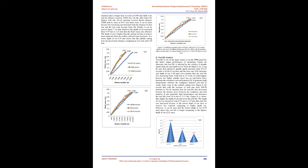Figure 7B shows that different feed rates from 108.58 mm/min to 391.42 mm/min also have an effect on tool wear. The lower feed rate of 108.58 mm/min takes longer to reach 0.309 mm flank wear, traveling a distance of 10,200 mm. On the other hand, the highest feed rate of 391.42 mm/min traveled a shorter distance of 9,200 mm to reach 0.311 mm flank wear, because the traversing rate increased with the increase in feed rate, causing faster tool wear.